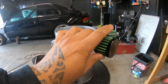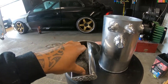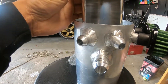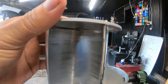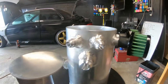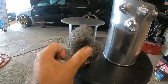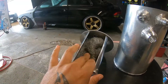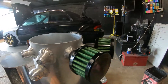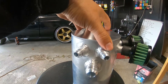It also starts clogging up the air filters making it harder to breathe, so I put something in there. Originally I was just going to have a catch so when the oil goes in through these fittings, it hits the back wall and goes straight down instead of being able to come out the filters. Then I thought I had some spare bits lying around — I'll put some holes in it and chuck some steel wool in, same as what was in my last catch can. That way it'll catch any gunk, so any air coming out is hopefully pretty clean. That'll sit in there in line with the fittings, we'll weld the lid on.